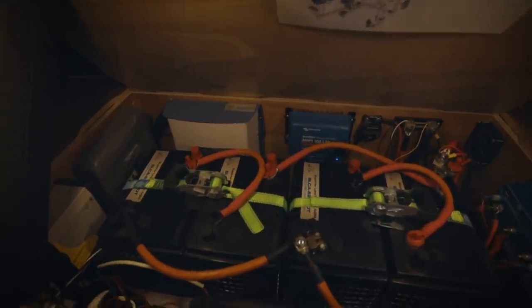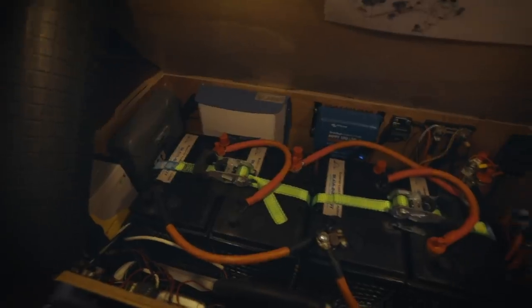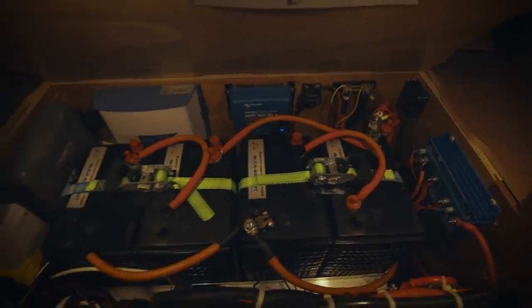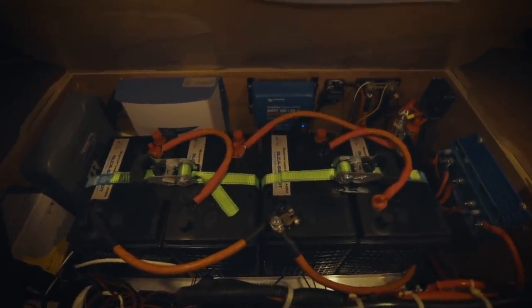We're all finished now with our new battery and charging system. Rob has been kind enough to help us wire it up. Didn't have a lot of space to work with here in the aft cabin, but we managed to fit in four six-volt batteries — 460 amp hours in total. We've done series and parallel, and we've also put in a Victron 30-amp charge controller for the four panels we're running, and a shunt for the NASA battery monitor, so we can keep an eye on everything. We're pretty happy with how it all turned out, and we should be able to give it a good test run on the way down from Portugal to Morocco.